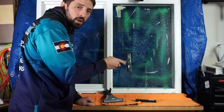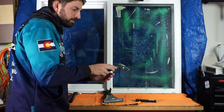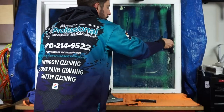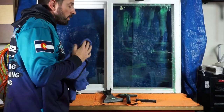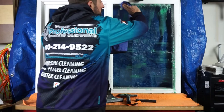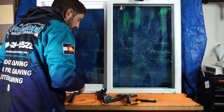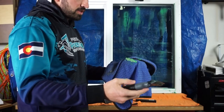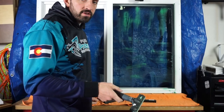So we've wetted our window and we're going to skip the screen. You'll find you have to go over the window a couple of times with any scraper since they just miss a little bit. The one scraper that doesn't do that as much is the Sorbo scraper because the blade flexes more. You can see we've gotten quite a bit off. Around the frame there's a lot of green paint — I always suggest cleaning that up as you go to keep your work area clean, especially if you're inside. Also wipe your blade off carefully to get a clean pass. Sometimes a good thing to do is wash it off in your bucket, especially with holiday paint on storefronts.